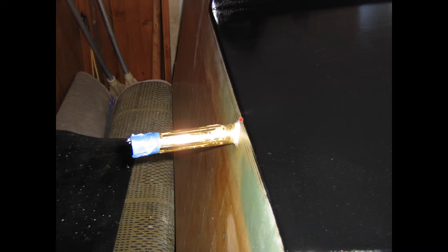I spread the thickened epoxy all around the inside of the hole we drilled in the previous episode. Remember, this hole goes through the transom — it's our bilge drain. I used epoxy inside the hole and then spread some on the outside of the tube. I also blocked the end of the tube with tape so the epoxy doesn't go inside. It forces the epoxy, as you slide the tube through, to go around the outside and make a nice cylinder of epoxy all the way around between the wood and the exterior of the tube.